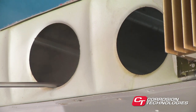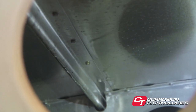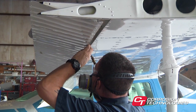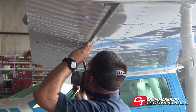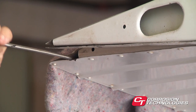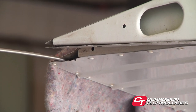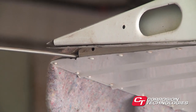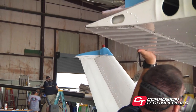The remainder of the wings can be treated through the inspection ports using the Superflex wand. When you complete the application, look through the lightning holes and inspection ports with a flashlight, or feel inside with your fingers — the surfaces should be slick throughout. Remember, some airplanes will have autopilot servos in the wings, so be sure they are covered prior to spraying. CorrosionX will not creep into the clutches, but you must avoid spraying directly on them during treatment. The six-foot wand is specially designed with a 90-degree directional spray, so it's ideal for treating control surfaces: ailerons, flaps, rudders, and elevators. Just insert the wand into the trailing edge of the control surface behind the ribs, making sure the direction pin is facing forward. Depress the trigger while walking backward. One pass should treat the entire interior of the control surface.